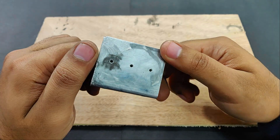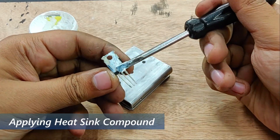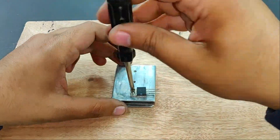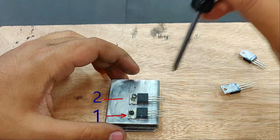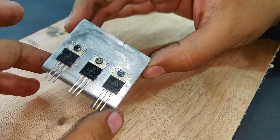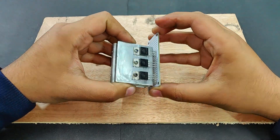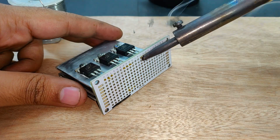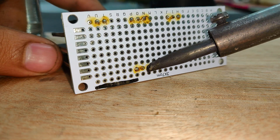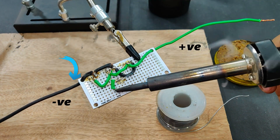That's the max I could do - it's much better than before at least. All the transistors that you see in the front will be connected in parallel. Here I am going to use this universal board. The green wire represents common positive for the collector, and the black one represents common emitter for negative.